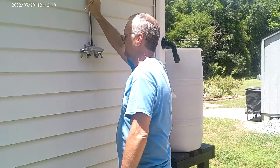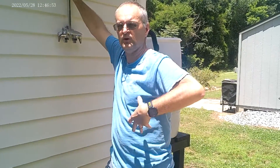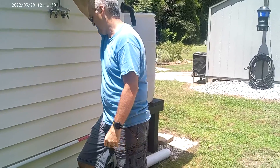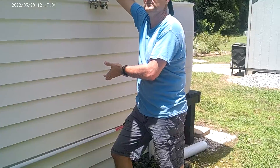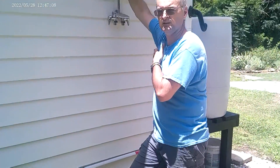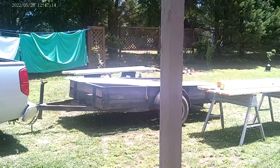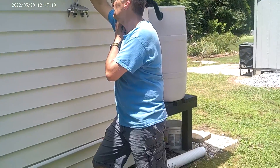So we're basically going to three-wall it with the door on this end, about a four-by-four foot shower. We'll pull it on the side and tap into the hot and cold water from our garden tub. There'll be a platform here, and we're going to wrap it in polycarbonate white siding, frame it out with two-by-fours, and use decking boards on the bottom.